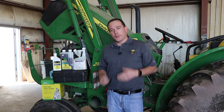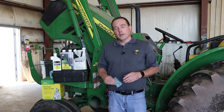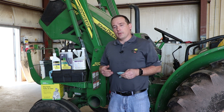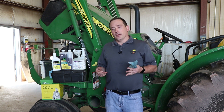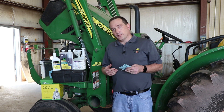I want to talk to you this morning about fuel. Fuel is what powers our machines today and makes it so we can do the things we want to do. About a decade ago, we had some changes to the fuel and how it's processed and treated. Now we have to worry about getting the water back out of our fuel systems. Most tractors are equipped with a mechanical water separator, but the situation you run into is that doesn't un-chemically bond the water from the diesel fuel.